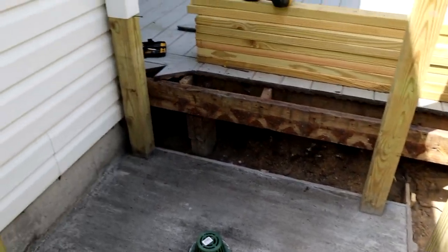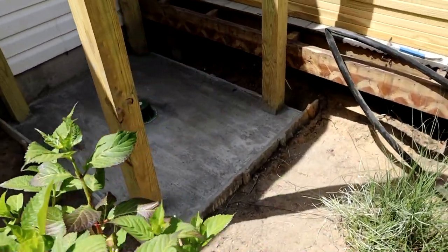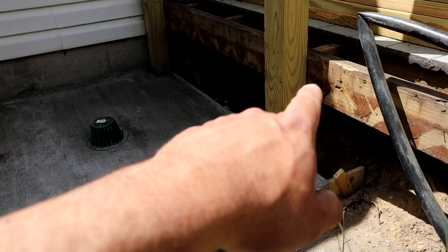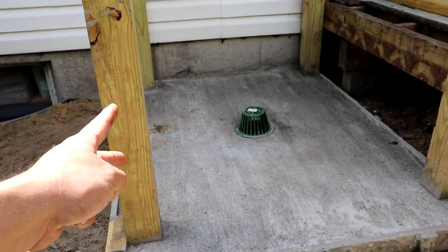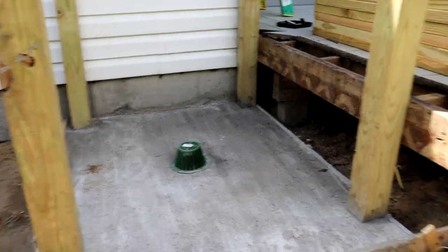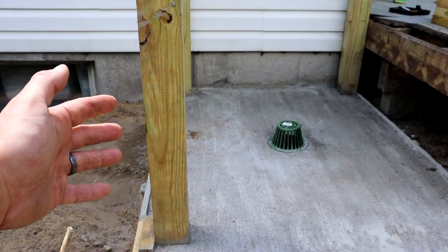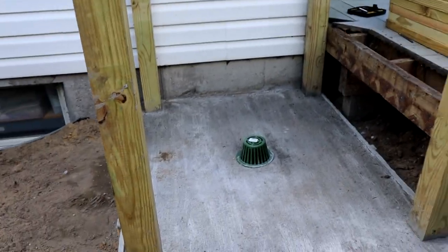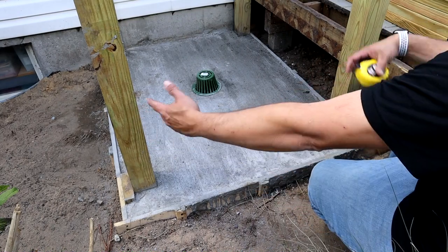I'm not going to do that out here only because that's a lot more work. We're dealing with a small platform here, and what I'm going to do to extend the deck out is just frame it with two by sixes to match the existing joists. I'm going to attach a two by six between these two posts here with carriage bolts, and there's going to be another one back there between those two posts, then we'll fill in the joists with joist hangers. For a small span like this, not that much load, it's going to work out just fine.